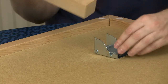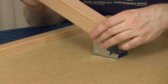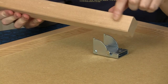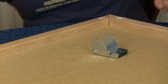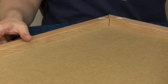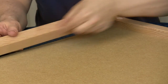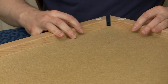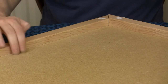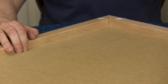What I'll have to do is, because this spindle is just very slightly too large to fit in that gap, I'll have to take a millimeter or so off one of the sides using the router. I'm also going to rout these edge pieces as well, and that will mean that they will overlap this board by probably about 12 millimeters or so.